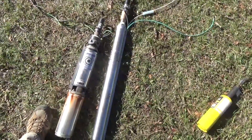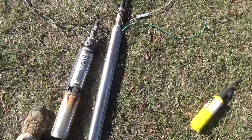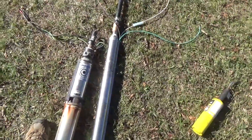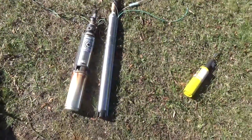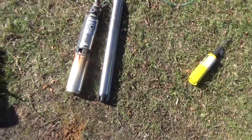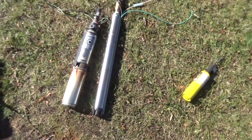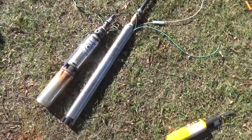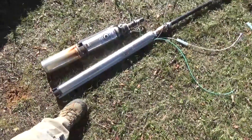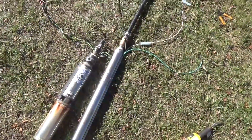The pump curve for this SQ series pump is good for about 196 feet, and it's a 10-gallon-per-minute pump, so I'm well within the pump curve ratings. It's also a soft start, so there's no locked rotor amp surge — it's not going to beat up the FETs in your inverter. It starts at zero and gets up to maybe less than a thousand watts to pump water.